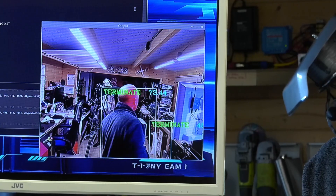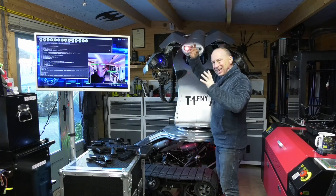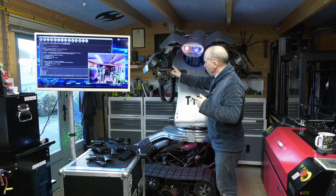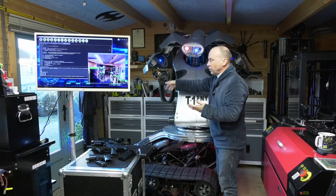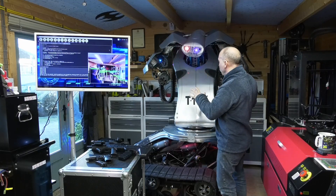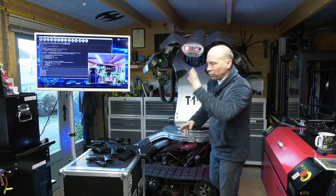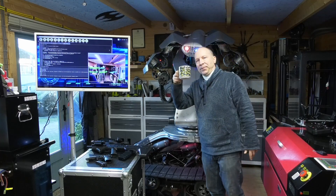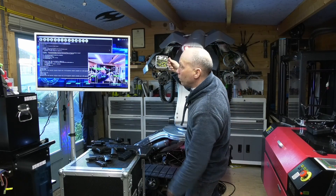So camera into Raspberry Pi, output through a video transmitter to a screen — our robot now has computer vision. And remember a few weeks ago I was talking about inputs and outputs on Raspberry Pi: an input is a camera feed, and the output comes from the pins on the Raspberry Pi that can trigger something — a motor simply spins when you apply power. So if the code says 'turn on the motor,' the motor spins. That's how we control things: turn a head, move a servo.